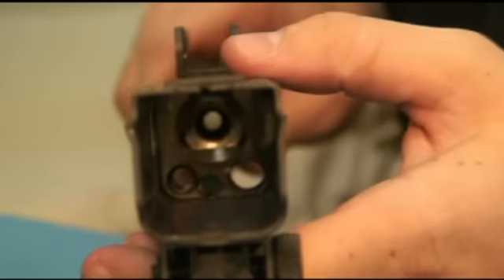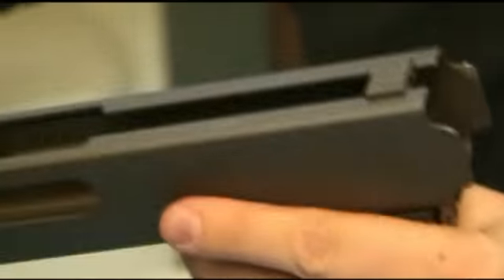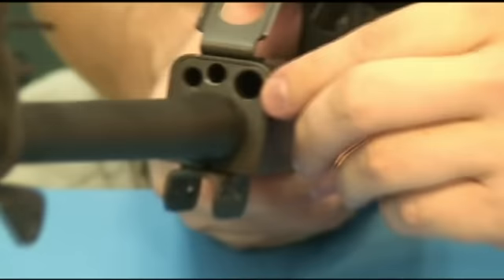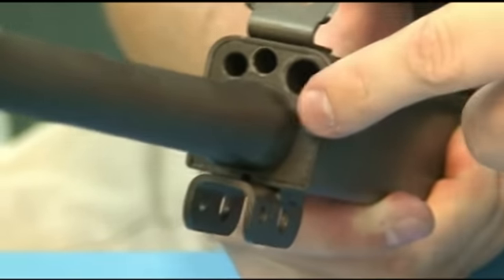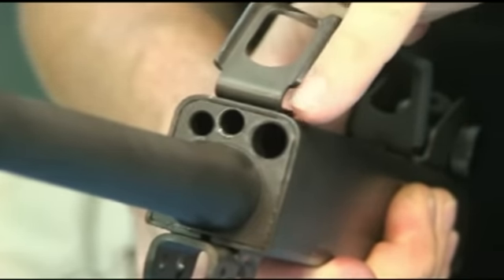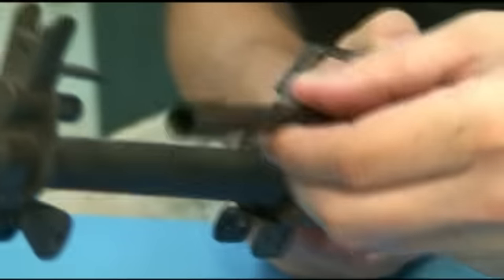Looking at the upper receiver, this is also a very simple component to manufacture. It started off either as a piece of commercial square tubing or as a flat sheet bent into three pieces, with a spacer spot welded in place and a similar piece up top — that dimensions the bottom surface of the receiver. The trunnion is basically just a cube of steel with a couple of holes drilled in it. The barrel is threaded in, and there are three holes on top: a small one for the right-hand bolt guide, a larger one to allow the charging handle to pass through, and the middle one for the gas piston.